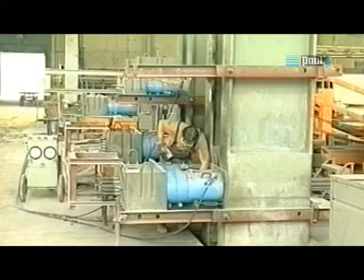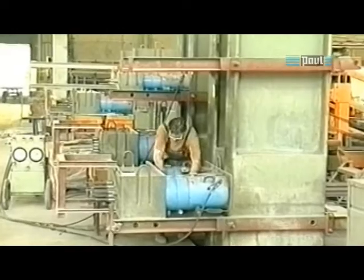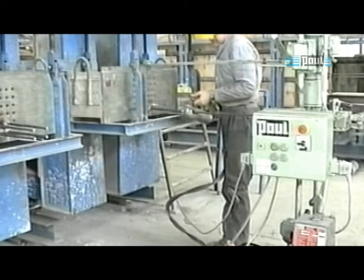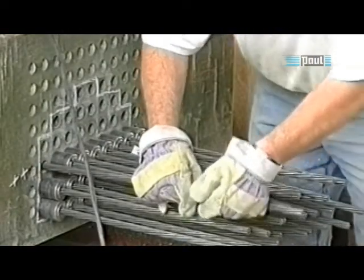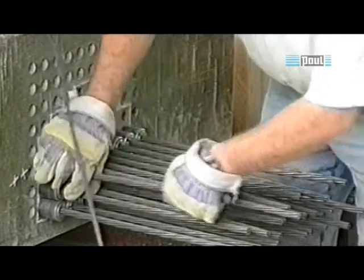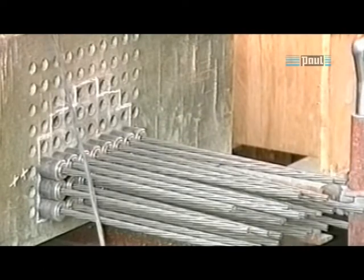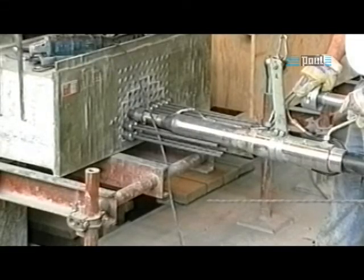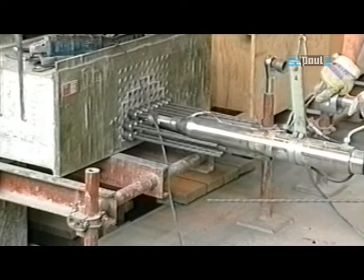On the detensioning end, the strands are anchored behind the transverse anchor plate. The strands are then cut off on the tensioning end — the best way to do this is to use a hydraulic steel cutter. The strands can now also be anchored on the tensioning end. With correct selection and maintenance, pole anchor grips guarantee secure holding. The strands are then frequently tightened, which facilitates the insertion of further strands and increases the overview in the reinforcing cage.